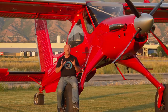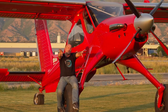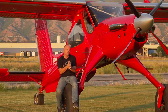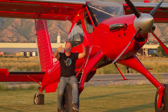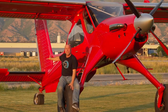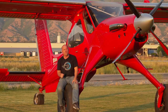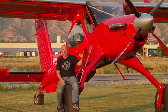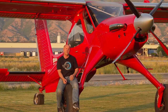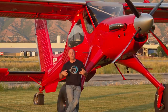That was finding out at what point when I throw the air forward out of the prop, it mushrooms forward and comes back — it recollects when you still have forward motion and comes back around your rudder and your elevator. However, if you get too much reverse thrust, the mushroom cloud pushing forward will go big enough that it will come back, envelop your elevator and your rudder, and blank them out entirely. There's a critical phase of touchdown before you can go into reverse — I can go directly into beta, maybe stop my forward momentum, give it a little bit of reverse. But at a certain thrust, I can actually mushroom the air forward and blank my tail. Blanking out your horizontal and rudder by going into reverse with too much power is going to make things a little bit interesting. What's really fun is I got to play with that and work my way into it.